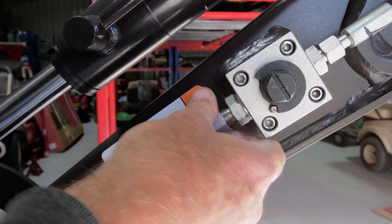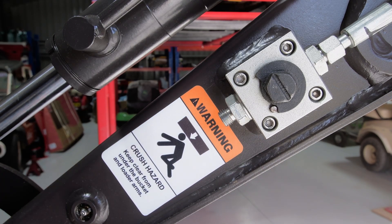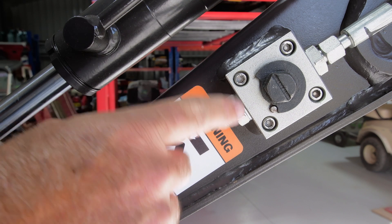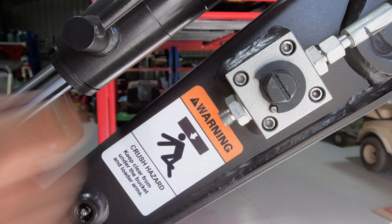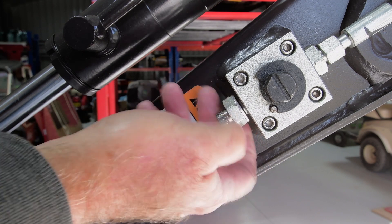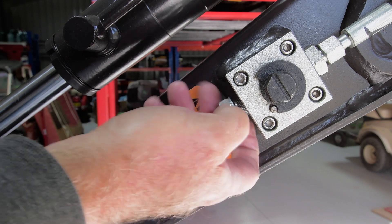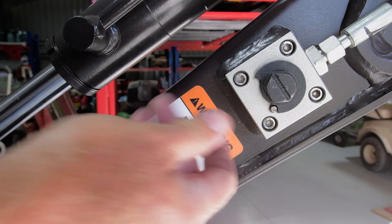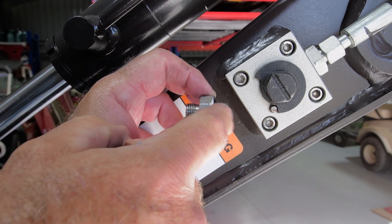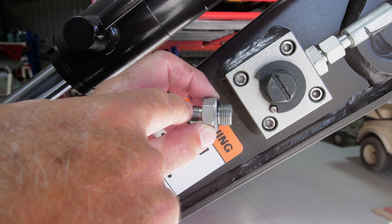So what we're going to do is do the conversion process — it's really quite quick. The first thing we're going to do is actually replace this part only, and this is called a hydraulic nipple coupler. I've loosened this off with the spanner so I'm just going to spin it out so we can have a look at what it is. When it comes out you can see that it's actually got two different sized threads — it's got a bigger thread on this side and a smaller thread on this side.